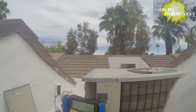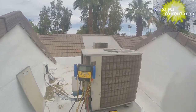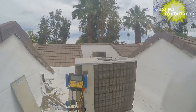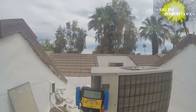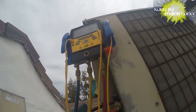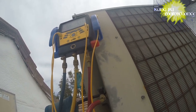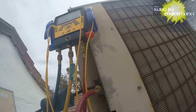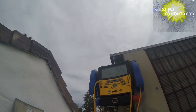But after a little while, I'll detach. I'll take my indoor wet bulb, outdoor dry bulb, and then we'll calculate superheat now that we've verified that our leak is fixed. And I might charge it to a good spot and then take lunch, come back and verify it's still at that same spot, and then detach my hoses and just prove out that I've actually got the leak fixed.